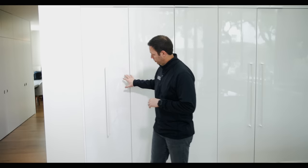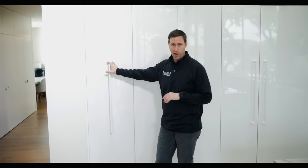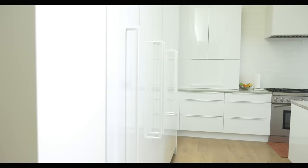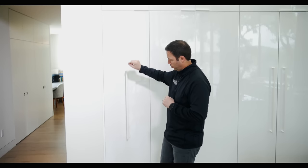Last, let's talk about cabinets and trim on cabinets. Our architect and interior designer worked with Wood Mode for these cabinets in the kitchen. I love this beautiful high gloss finish, but this detail is what I wanted to point out. Anywhere cabinets are meeting another area — whether it's a wall or a floor — it would be traditional to see scribe mold in that area to cover up that gap or any minor differences. But in this case, we've scribed the cabinets. That means we've actually put a pencil line where they meet up against the wall or against the floor.